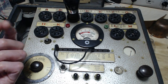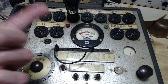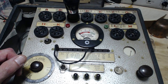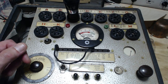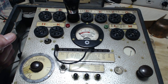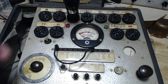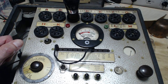I was reading up on some old tubes including the WD-11 — that's my prized possession. It said the reason the WD-11 was eventually taken out of service, only lasting a year or so around 1921-22, was because its failure mode was damaging radios. What would happen is the filament would burn out and break, and the filament wire would travel until it contacted the plate. Then you'd have plate voltage directed back into the filament circuit of the radio — burning all the filaments out rapidly. So it was a bit of a suicide tube, and that's why it was taken off the market.